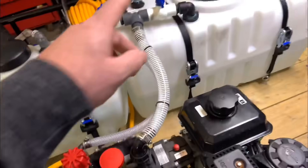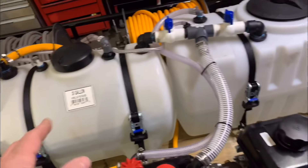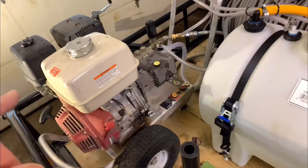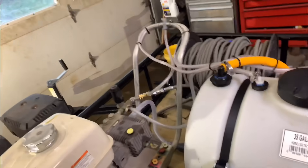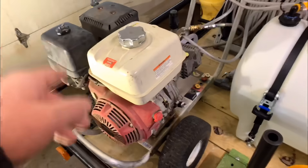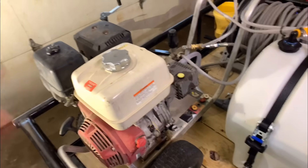This is the chemical pump setup. It went with a 50-gallon soap tank and a 35-gallon water tank, and that is plenty for this four-gallon-per-minute machine. This four-GPM machine is a direct drive and it pulled just like pulling from the water tank — no problems at all, it pulled completely with no issues. I also put new oil in the pump and changed the plug, so he will be ready to go this spring and hammer down.